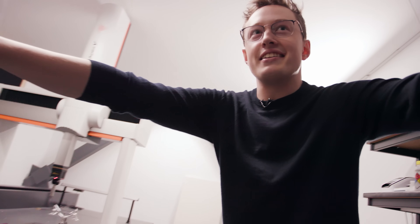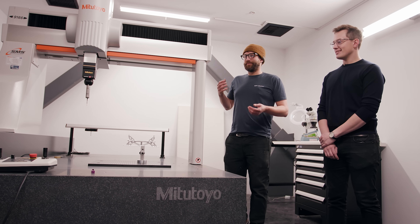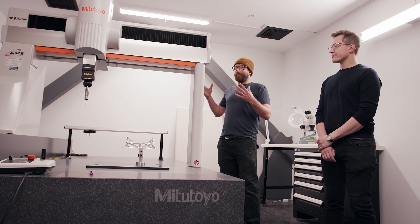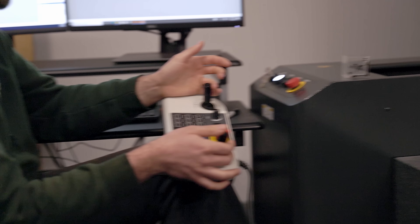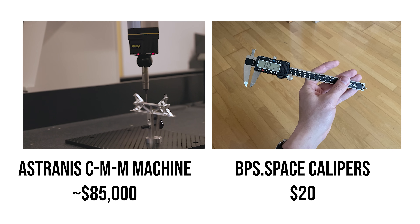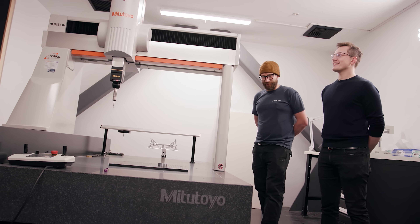This is our final step in our inspection process. One of the coolest parts about this thing is how precise it is — it's got the capabilities of measuring into the basically micron, sub-micron level. This machine has a tiny probe on the end, and it exists in a climate-controlled room on a solid slab of granite to check the dimensions of parts with unbelievable precision, far more than a standard pair of calipers could. This is the most humbling machine in the shop — it's going to show you everything that went wrong on the machine. When you think you're a good machinist, this thing is like a wake-up call real quick.